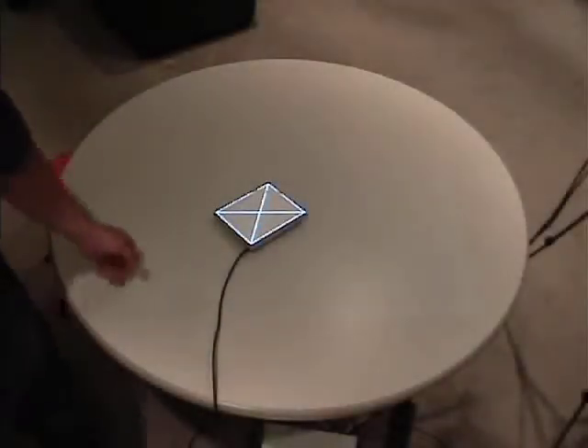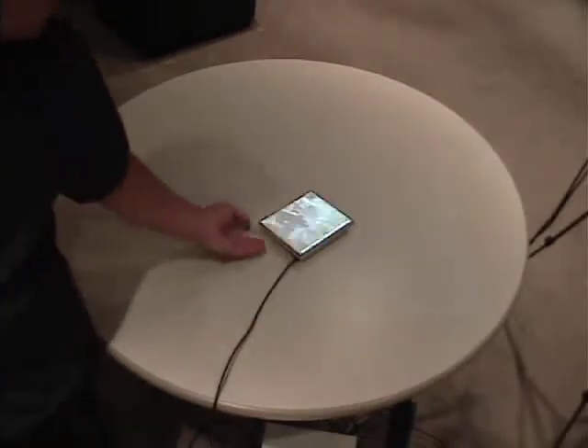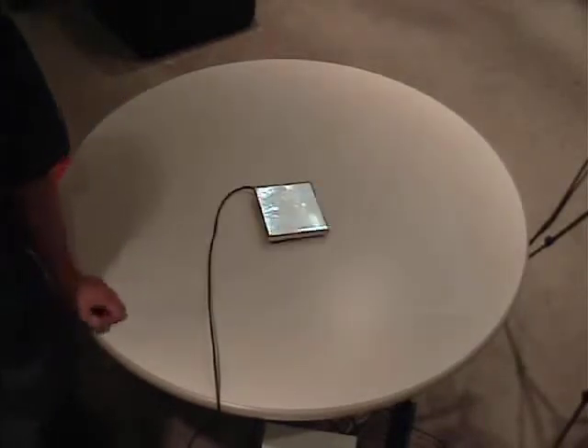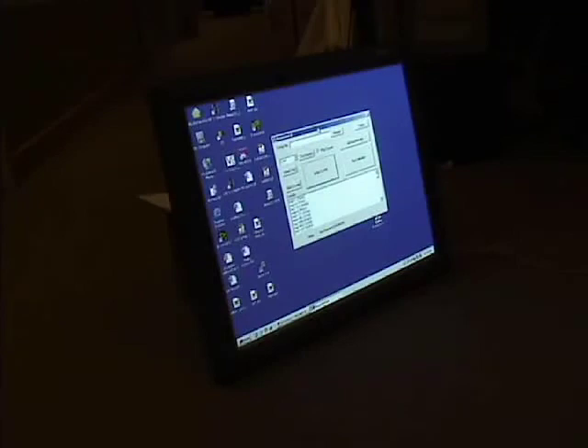This wireframe test pattern that I've been using is mainly to make it easy to see the quality of calibration. But using OpenGL or DirectX, we can warp real-time video on low-cost commodity hardware. We also have an implementation that allows us to warp the active Windows desktop, creating a fully usable calibrated display.